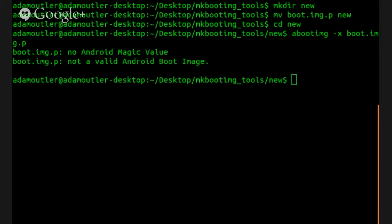Well, you can probably write to it using a lot of your standard tools. Yeah, but even with DD, you usually try to DD the thing. I didn't know there was a way to patch with DD, for example. Well, you can use standard C utilities like fopen, read, and write to read and write to block devices on at least a lot of devices.